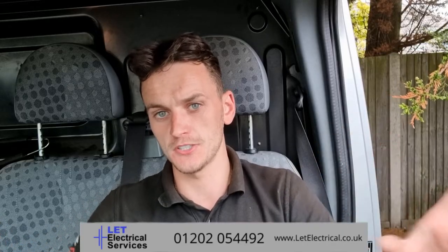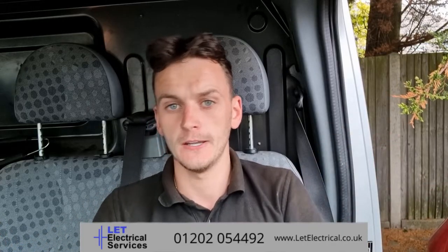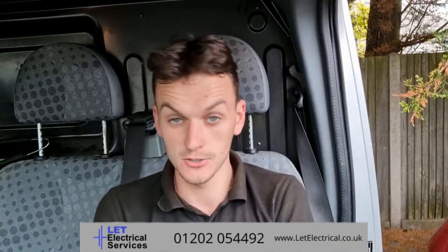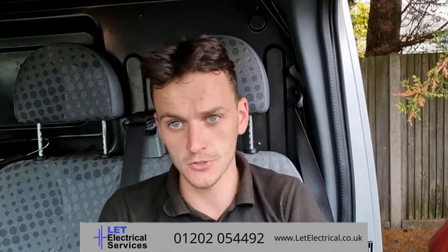Hello, and in today's video we're installing some 2x 6mm armoureds from the indoor consumer unit to two separate consumer units - one within the home office and the other one within the garage. We're putting supplies into the new consumer units, connecting the new consumer units on, then connecting them inside to the mains, testing everything, issuing certificates. But the consumer unit wiring side we're going to do at a later date. If you enjoy it, don't forget to like and subscribe.